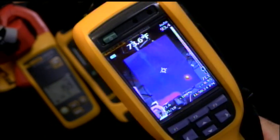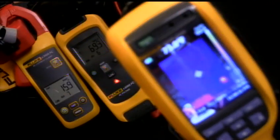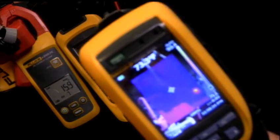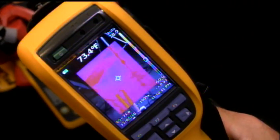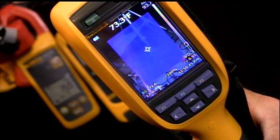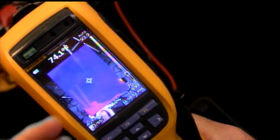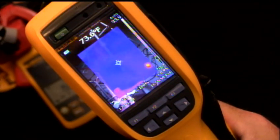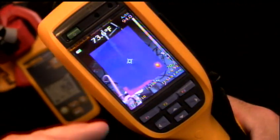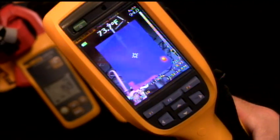I just want to touch a little bit more on the thermal imager since they sent it to us — we don't normally get these. One really great use for a thermal imager is if you have electric motors, which are the lifeblood of most manufacturing facilities. Here's an idea: you go around and take a baseline temperature of all your electric motors operating in a nominal mode. Now you know what temperature they should be running at under normal conditions. When you come back to do your preventive maintenance, you quickly scan all those motors. If you see a motor that's hot, you immediately know something is going on — it could be an excessive load, low voltage going into the motor, bearings going out, or a lot of different things. A thermal imager is really a must-have for any manufacturing facility, particularly if you've got motors.